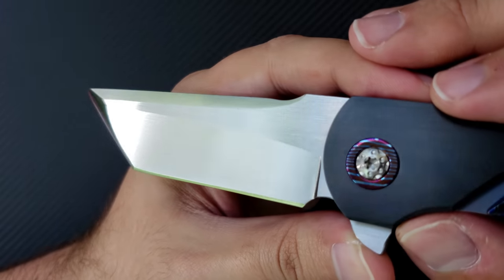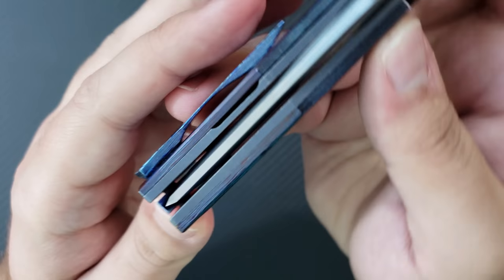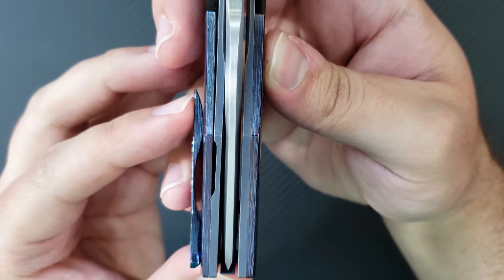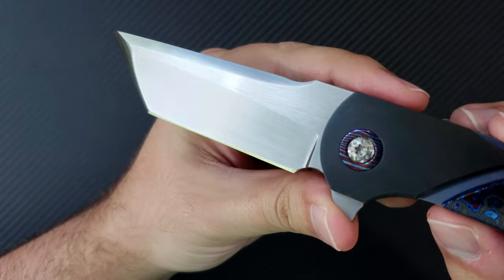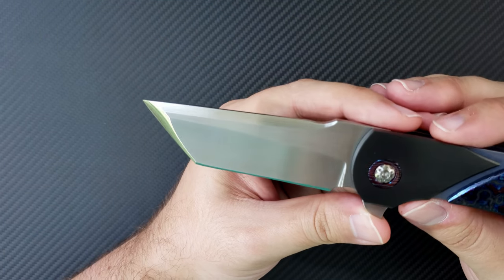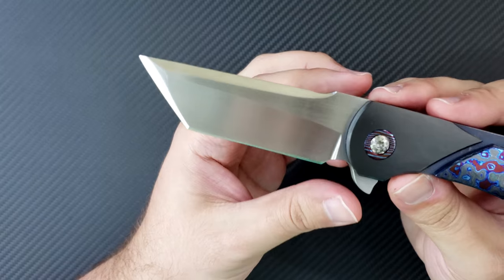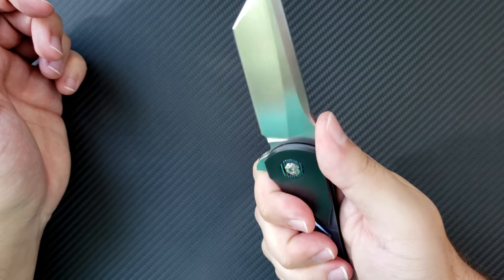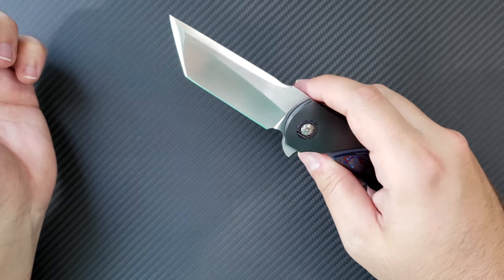What I really like to see is that Ian's freehand grinding has gotten even better. If you saw my video on his Crusade number three, you may have seen that the grinds were a bit uneven in terms of the top swedges, but now he's got it down to a science. He does this totally freehand without any jigs, so it's very impressive to see the evolution of his grinds. If you look at the knife on this side and then flip it, it's very symmetrical despite the freehand nature of the grinding. It's done with a nice hollow grind on the primary bevel, this awesome tip with a beautiful satin finish — a hand-rubbed satin overall. It's got a nice sharpening choil, a flat area for the thumb to rest on the blade, and even a little dip in case you want to use the blade that way.